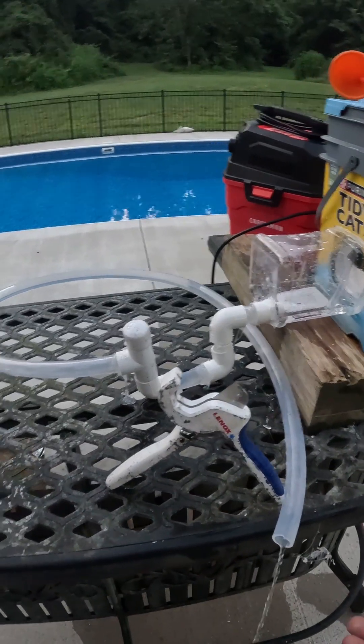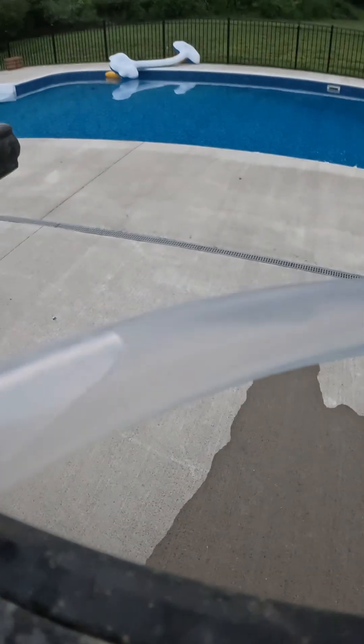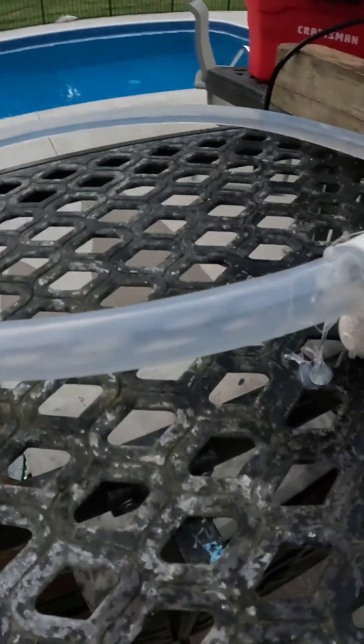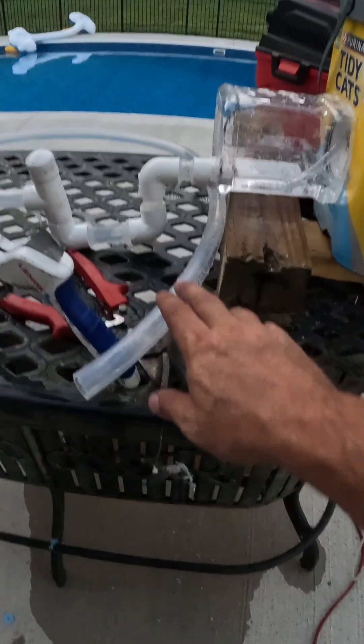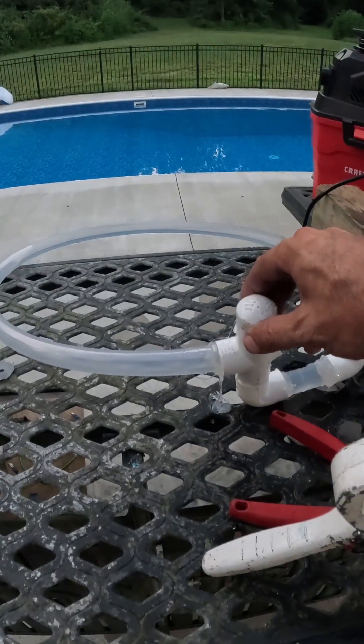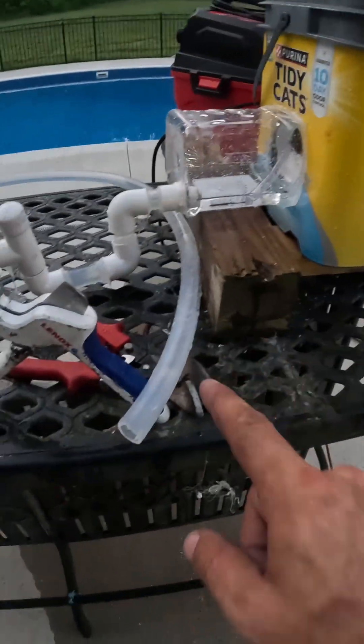One thing we do have to be cautious of is when we create a second trap. Now we have a second trap — the water is all the way over here. The pressure inside between this water and that water is actually higher than atmospheric pressure, so it's actually pushing back on the water. You're back up above the line again. As your drain run is running across the attic and it makes some unintentional sags, you have to be careful about that. If we open this vent up there would be no pressure and it would continue to drain as normal. We can also lower this back down and we'll see the line getting back closer to normal.